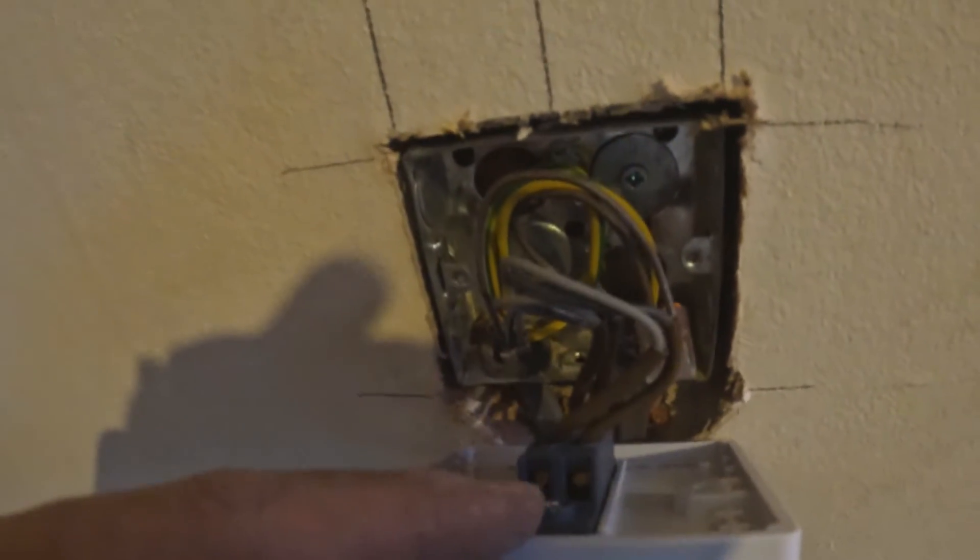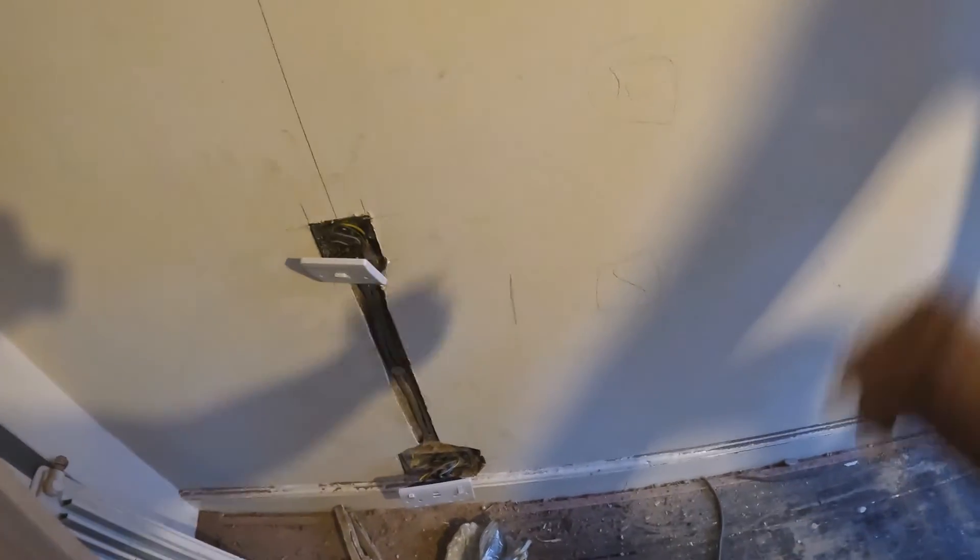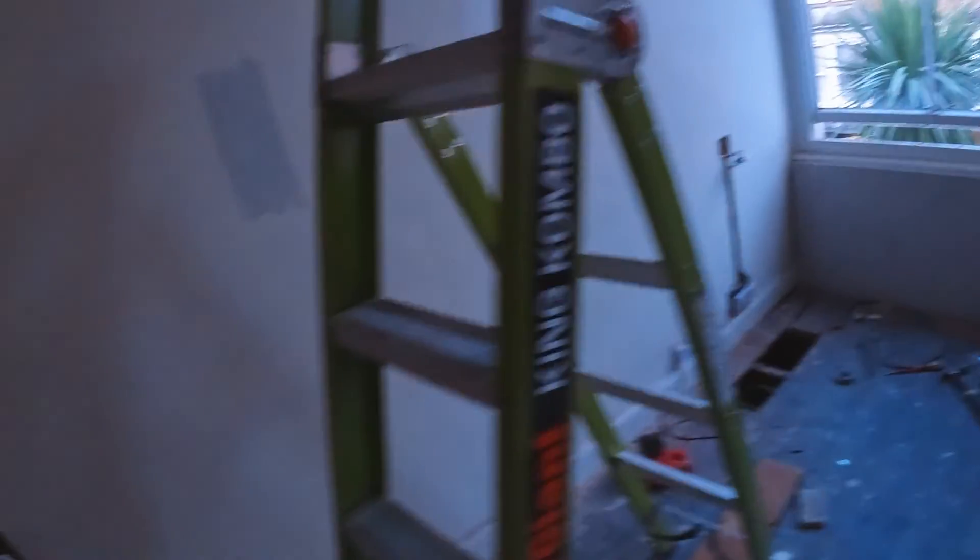We've got the power back on. Intermediate switch — that's it off. There we go — that's it back on. That's it off again. It's all working. So on that three-core cable running through, you just tap in permanent live, neutral, and earth. As long as it's wired common, L1, L2 on one switch and common, L1, L2 on the other, any intermediate in between — put a little connector block in for the common, and for the strappers just go one terminal, two terminal, one terminal, two terminal. You could add another intermediate anywhere and it'll still just switch those strappers around, which turns the lights on and off.